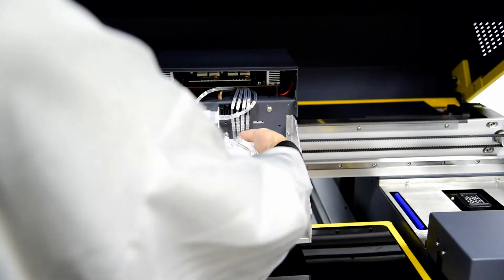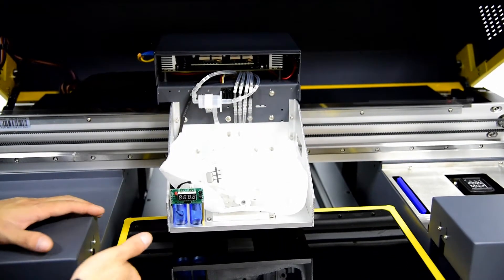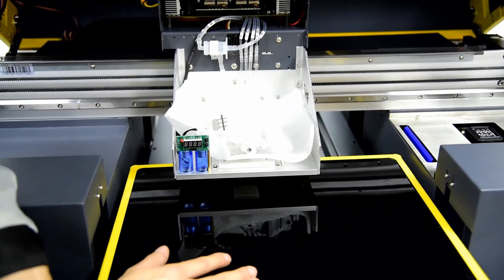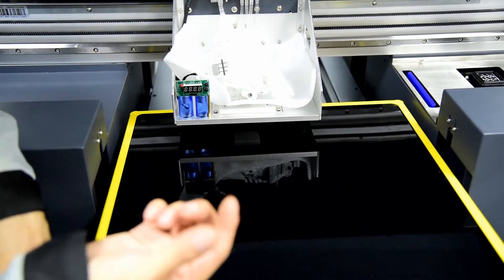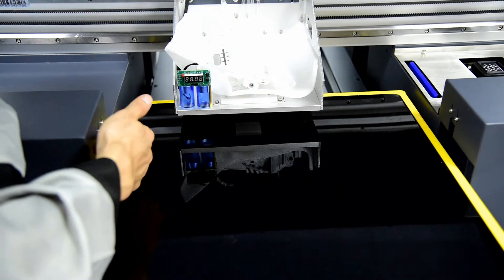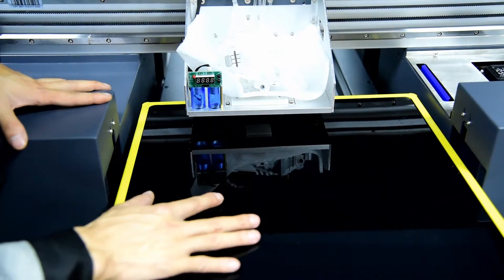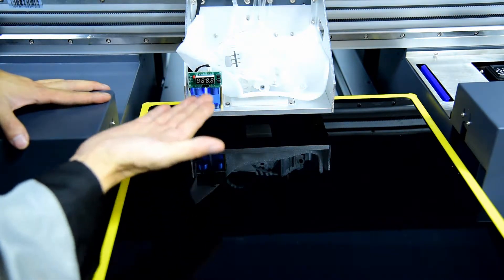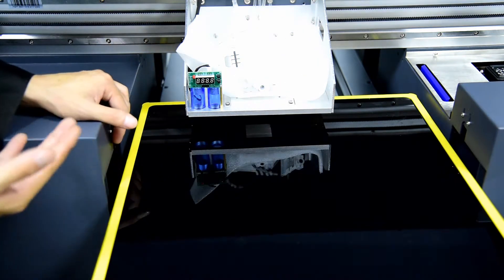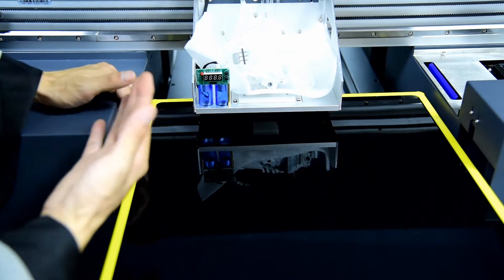On the flatbed there are two screw lock sensors — these are the up limit sensors. Because different materials have different thicknesses — hoodies and jeans are thicker than t-shirts — we add an up limit sensor here to detect when material is in the up position. Every time before printing, you need to place the material and adjust the up-down height to set the correct gap between the print head and material. When the material is over position, the motor stops to protect the print head from being scratched. For extra safety, always visually check before printing.